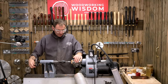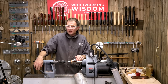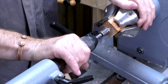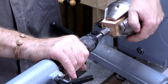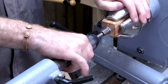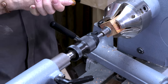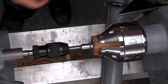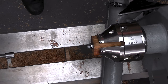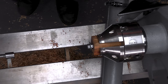Now with this, we are not going to run the lathe. What I don't want to do, barrel handle on the outside. Now I've got position. I'm just going to turn this up by hand, so the coarse thread will wind in. I've got everything nice and straight as we're doing it. So I'm using the tailstock to give me alignment. Now, in reality, any of you with an engineering background will go, that's an engineering thing for hand cutting a thread. Really easy to do. Nice to do, gives you a good position, gets it parallel, makes it controllable, and no effort to fight it,